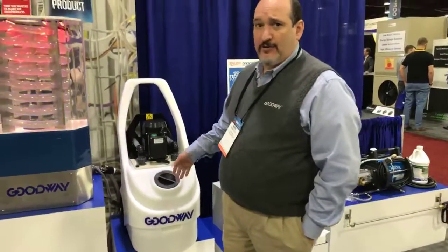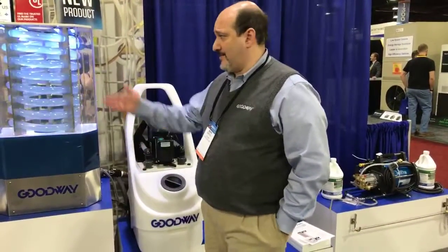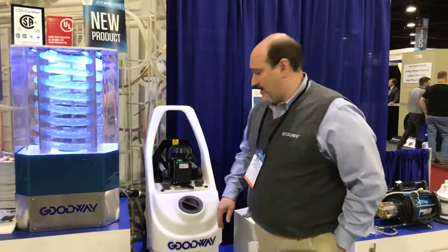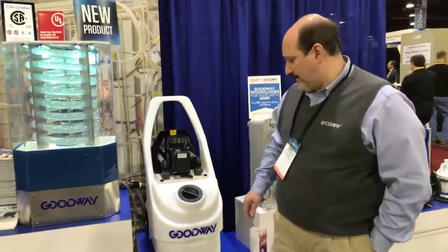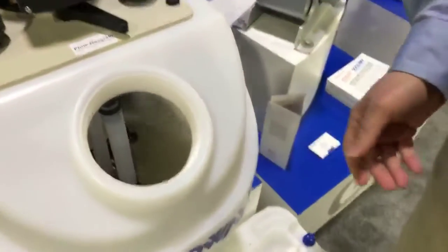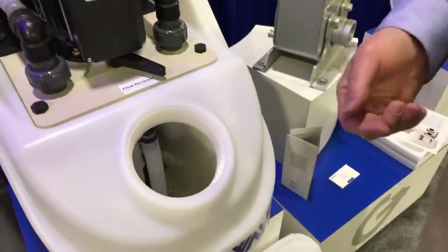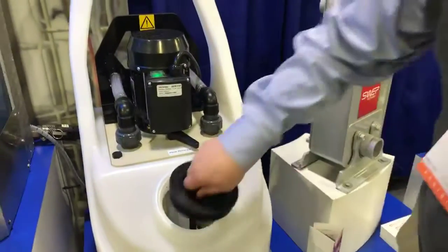What you have here is a recirculator that you can use to put acid into different systems. This is a depiction of a heat exchanger, and the idea is you want to be able to circulate a user-friendly acid through it to descale it. What we have here is a port that you can just put your chemical into. It's not a submersible pump sitting in there that's going to have any trouble with seals going bad or something like that. It's just a long plastic impeller that's moving all the chemical through it.